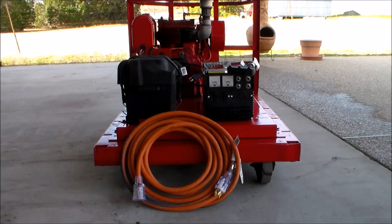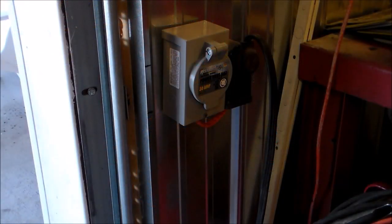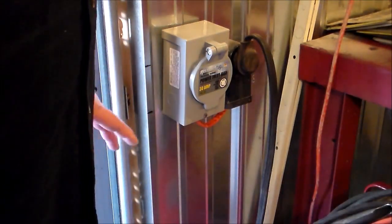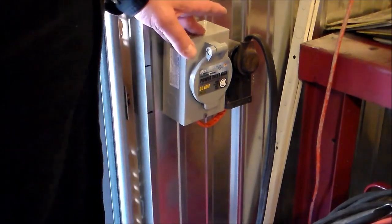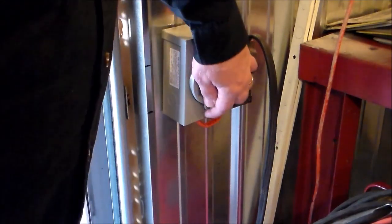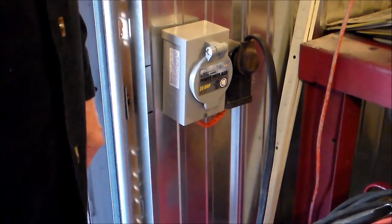When I had put the plug on the shop for this generator to power, I had to buy a few other accessories too. I bought a 25-foot, 30-amp supply cable for the generator. This is how I can hook the generator up to my shop. In case of a power outage, I'd cut the main breaker off in the shop. This generator plug ties into my welding box — you would just flip that up and plug it into the generator and you're good to go.